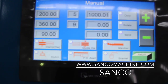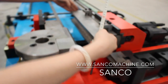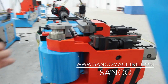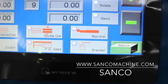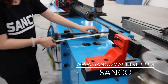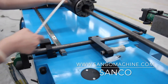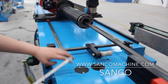PD assist means this part also moves forward to push the tube when the machine bends. The bracket is this part — it can move up and down. It goes up to support the tube, and when the carriage comes to this position, the bracket goes down to avoid a crash.